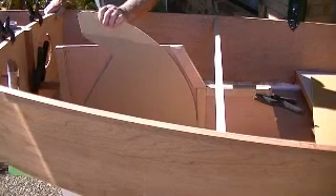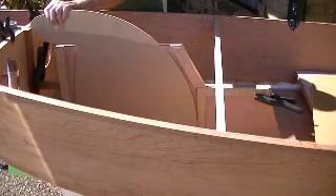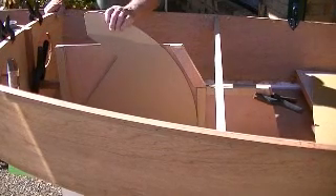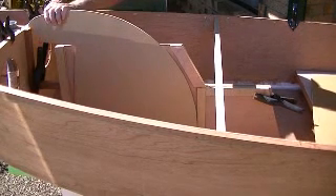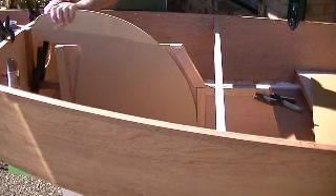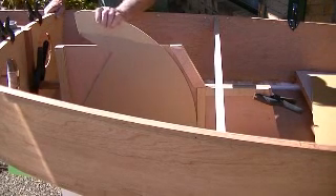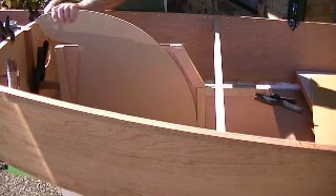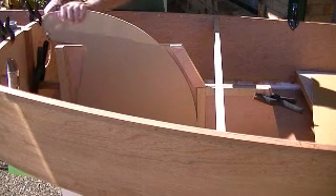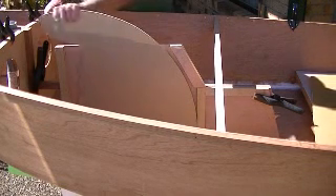The other side hasn't been put on, but you can see if it's pulled up or if it rotates down, you can change the angle of the centre board. Sailing off the wind you can pull it right up, or you can adjust it to reach higher into the wind if the conditions suit the way you're going with the boat. We'll move on now and finish off this centre case.